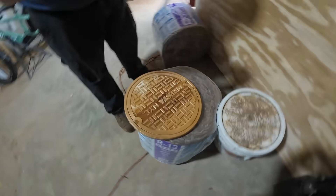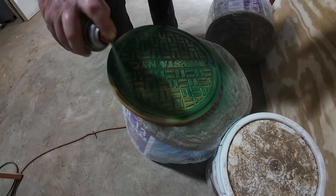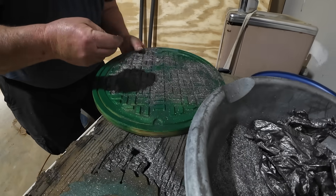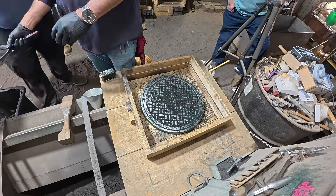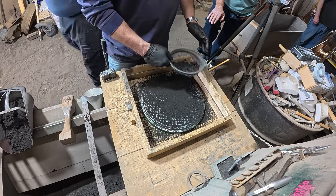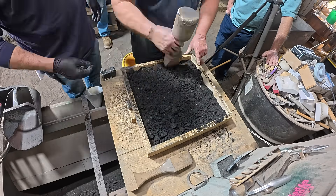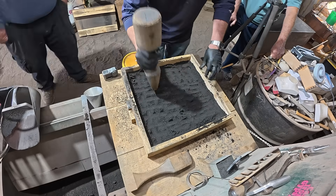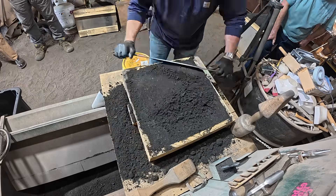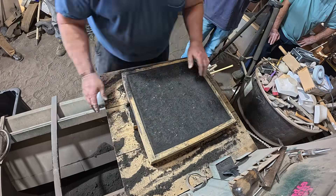I coated it with polyurethane, and now a few days later I'm in Mississippi at Clark's place. We spray it just to fill in some of the little tiny voids, but really the spray paint works as a little bit of a glue — the wet spray paint keeps the graphite in place. We're putting graphite on it, so when we put it in the green sand to make the mold, you put it in a flask — the square frame — and I'm shaking out the green sand, which is designed to stick together with moisture from water. You put it in the muller, which mixes up the sand with a little bit of water, and now with progressive sifting — the finest being on the face of the mold — I'm using the tamper to compact it. Clark is giving me some instruction. I'm at Windy Hill Foundry in Mississippi.